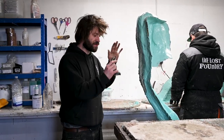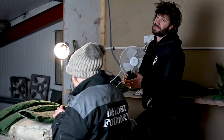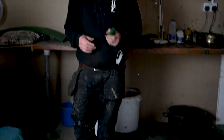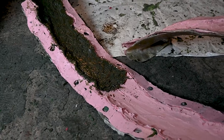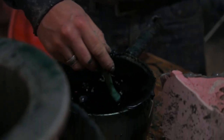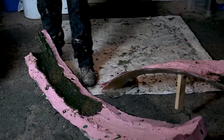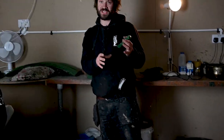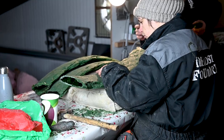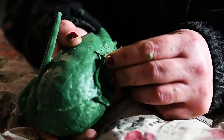I just want to introduce you to the first process of sculpture being cast. Once the mould's been made, we bring it upstairs and then Vera casts the wax into that mould to make a positive of the sculpture that you want to cast into bronze. You can see that Vera has started casting wax into the mould. This is going to be bolted together and then what we call slush cast — we pour wax into the mould, move it around, and it seals both edges, giving you both halves adhered together. Once we've pulled those sections out, Vera then takes time to fettle the edges and get rid of any seam lines using white spirit and a little bit of heat, and she blends in and sculpts back in those seam lines.